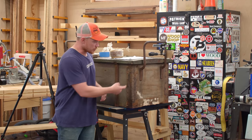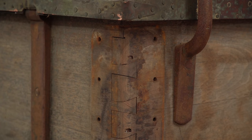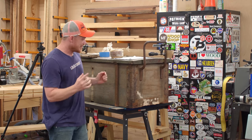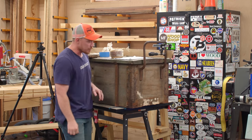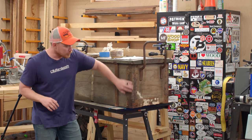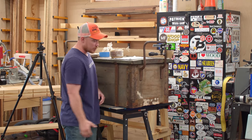We've never seen this before. So the tails, every other tail has a cut nail pinning it to the tail board. So you have mechanical connection in one way, you have split nails going in the other direction, glued together, and then there's a big piece of steel brace, iron bracing that goes around these corners that have 1, 2, 3, 4, 5, 6, 7 screws into the case. So it's a really strong joint that is being protected and reinforced with a steel plate.